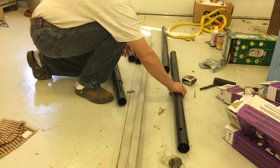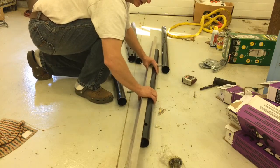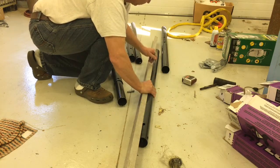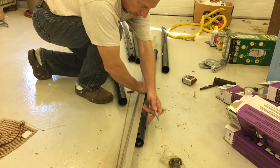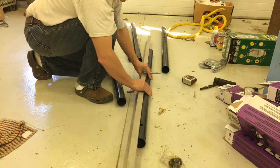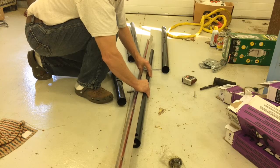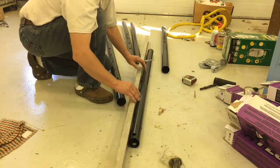So there we've got that larger tube marked, just as I've already done on those other tubes. On the smaller tube, this one only comes with two pinholes at this end. Just in case I want to add some more adjustability, we might add some pinholes on this end as well, so I'm going to mark both ends. Mark it up here because there's already a pinhole here and here, so we'd be drilling somewhere out in this area. Put a nice long mark on the other end — again make sure it's seated properly — and rotate it once more to the fourth pinhole position.